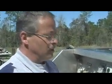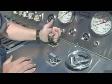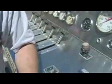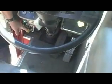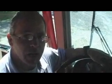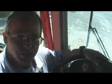Okay, we're going to shut down the operation and bring the truck back down to idle. Set that all the way down. Close all valves. Okay, and then we're going to go into the truck. Put the truck in neutral. It now says neutral on both sides. We come over here, go from pump back to road gear. Truck's back in road gear. Now we disconnect everything, roll it up, put it all away, and we're ready to roll. And this concludes pump operations for engine 94 drafting.